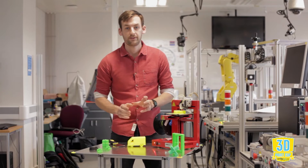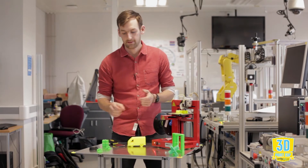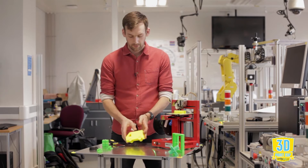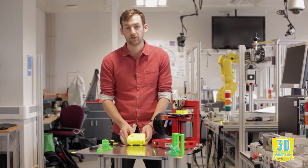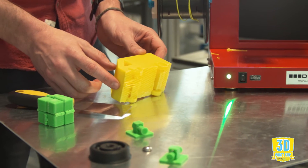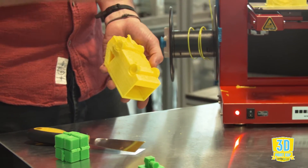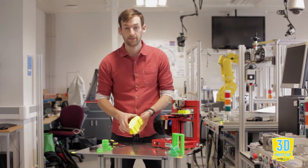We've made a lot of references to tolerance. Tolerance is the gap between the two solid pieces — it's the air that lets the piece move. We've created a small van with some problems deliberately added to show you how this works. The layer underneath has zero tolerance; it is a completely solid piece, which means when the next layer of plastic goes on they'll fuse together. This is how we create our solid pieces and we don't want them for movable parts.